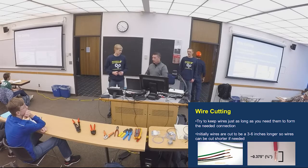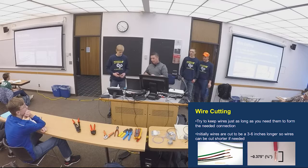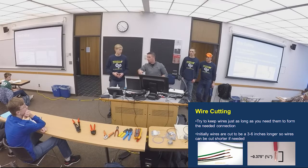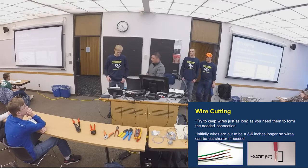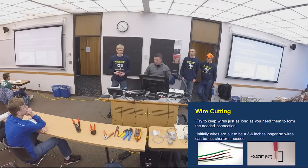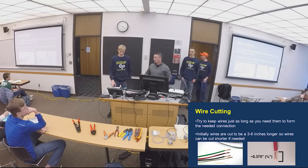You're going to save yourself a lot of problems and those nuisances that Todd talked about. The other side of it is you can buy the multi-connector that looks like this, but I don't know if you can hear that. You can actually hear it rattling. You're probably not going to have enough strength to crimp. It'll give you all your crimp sizes, but you're going to have to crimp them so tightly that you won't necessarily get a good crimp. If you get one of the ratcheting ones, you're going to get the downforce you need. The tool will do that for you, and it'll be the right tension. When you're stripping, those ones are a lot easier to work with because you can work right up here, and you're going to get a clean connection. If these teeth don't line up, you're going to get a terrible strip. So for some of your key electrical tools, make sure you're getting quality tools. It's going to make doing the rest of the work 100% easier.